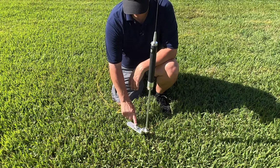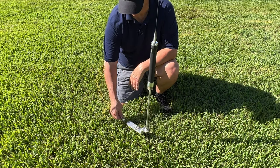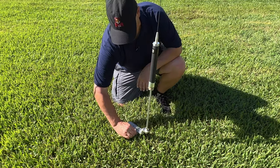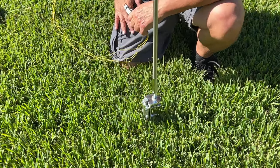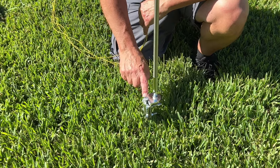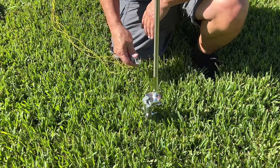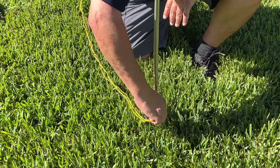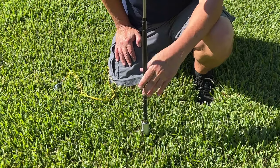Super Antenna has provided spade terminals for their radial systems. With the system that we're using, you can clip this directly to the base, you can clip it to the ground spike, you can clip it to the spade. This antenna mount may look familiar to you. It's the lowest cost antenna mount ever, with a 98-cent ground spike from Home Depot. With this particular setup, you can clip directly to the bolt on the mirror mount, or you can clip to that 98-cent ground spike. Here we have 2 completely different pieces of equipment.